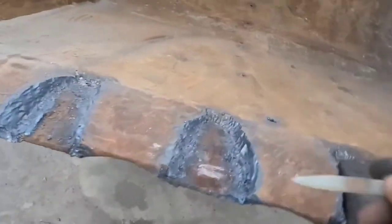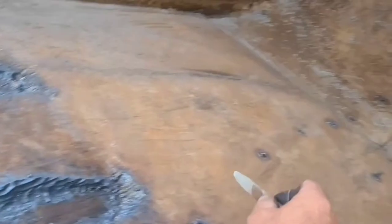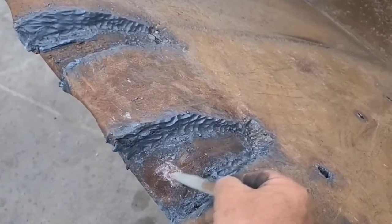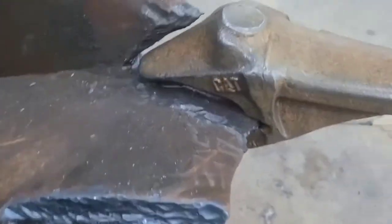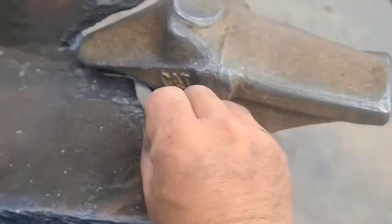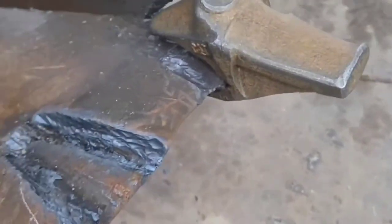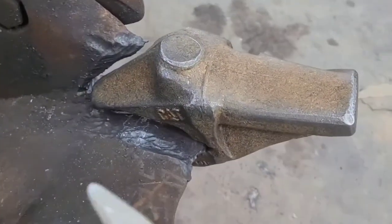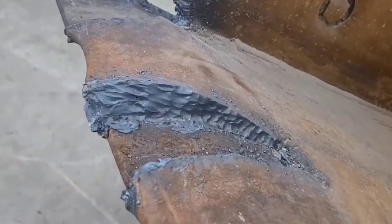And that's because of the way this plating was done by the previous repair. The previous welder added that plate on the inside, and they added this plate right here. See, this is the original right here, and this is what was added. So if you see what it's like cutting one of these shanks off, if you want to cut this weld off right here, the way they welded this entire thing in solid and they welded right over the weld to the shank, the only way I could cut these shanks off was to remove all of this material.